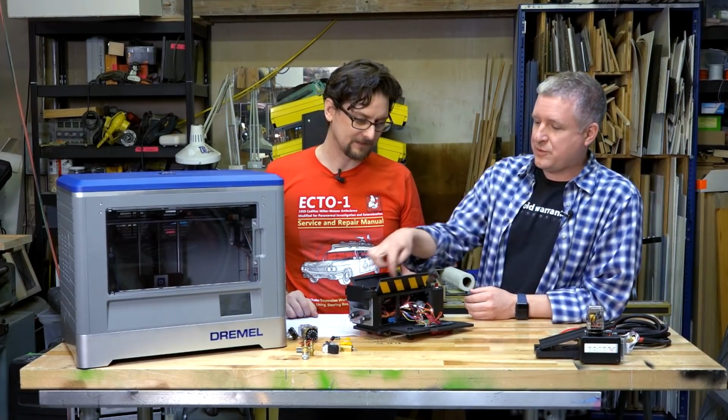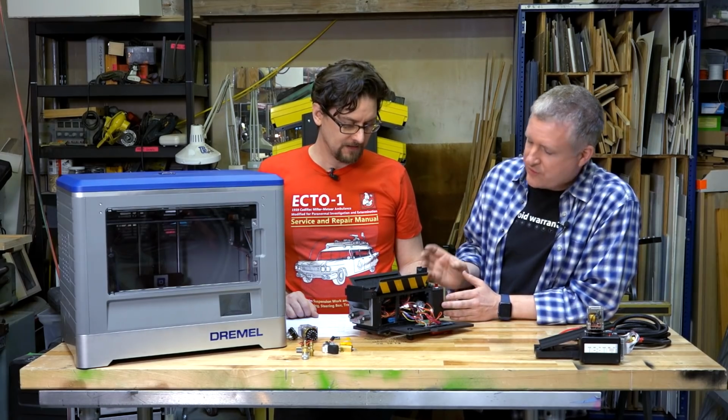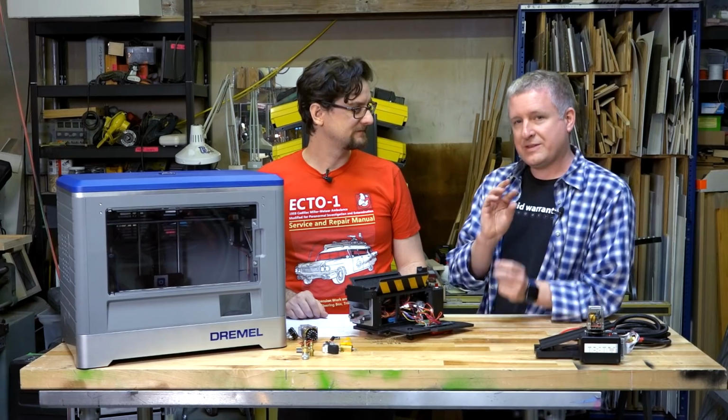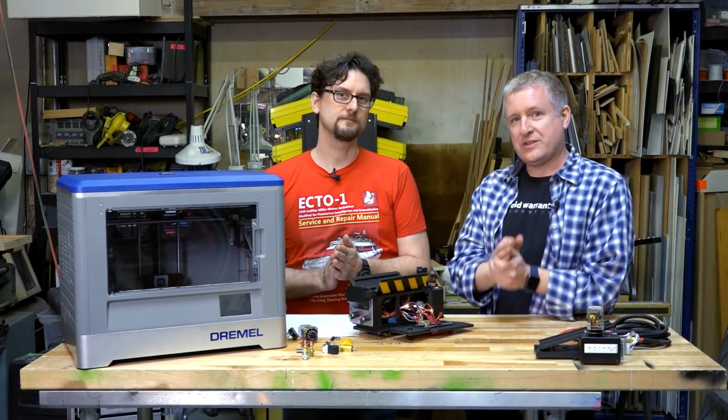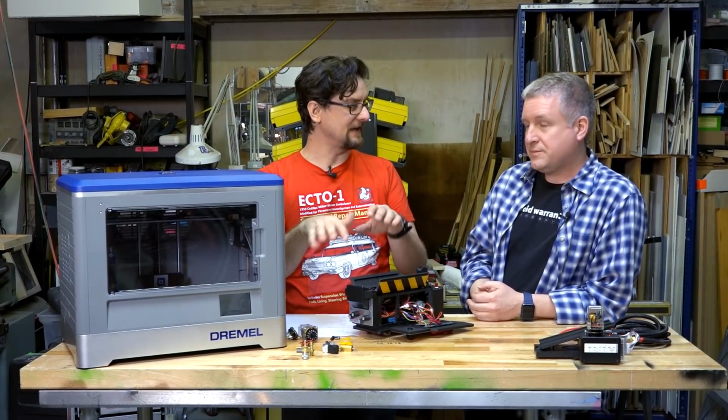Yeah. So like the 3 flasher LEDs, and what else? Is it the motor or the smoke machine? Yeah, we put a transistor on the motor. Those all run on a transistor, which basically acts like a switch. So the Arduino sends a signal, and it just opens up the current from the 5-volt rail. So that's where we can get the flashing of the lights and all that stuff.